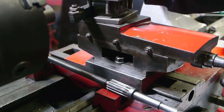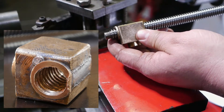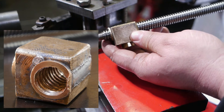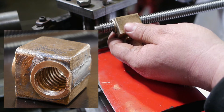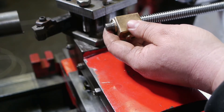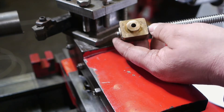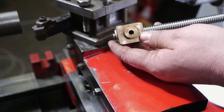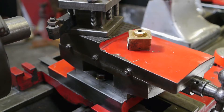I managed to free up the cross slide and I found the worst looking acme nut ever. There's at least one and a half turns of backlash in here. Somebody did an awful job making this thing — it doesn't even fit the mounting hole on the back of the cross slide, and the mounting hole was drilled out for some reason. So I'm not going to use the cross slide; I will just tighten up the gib and use the compound slide instead.